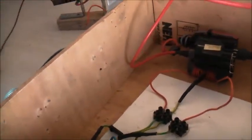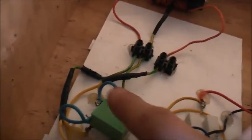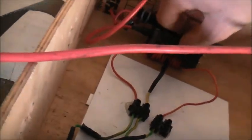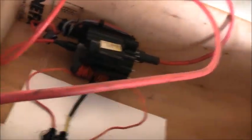Just charge that. That'll do - reconnect to the capacitor, that's the one to charge it. And now I'll use this one. That's neat and set up there. Beautiful. That's what I glued down. Much further away than the other flyback was, so I'm going to use this monitor's flyback from now on - thick wire, further away, glued down.